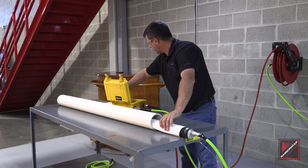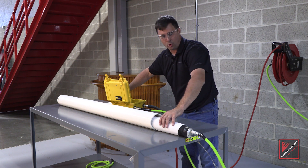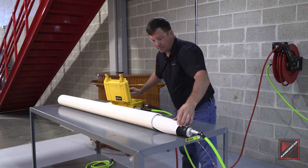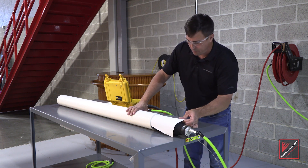I'm going to slowly inflate my Packer, watching it, and don't rush this process — take your time. You want to ensure that the Packer is properly inflated but at the same time not overly done inside the host pipe. Slowly creeping up, watching my Packer and my paper, and once it reaches that PSI we're going to give our paper a nice little tug.